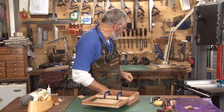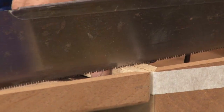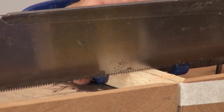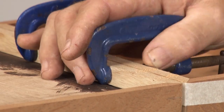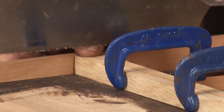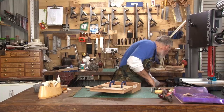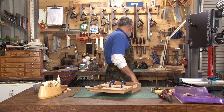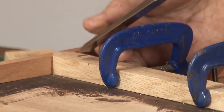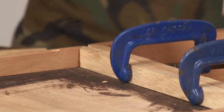Now if you want to, and you're very gentle, just take that down a little bit with a very fine saw, just on the inside of the cut, but don't go too deep because you don't want it to go deeper than the depth of the hinges. And then grab a sharp chisel, and I just notch out up to that line, so I've got nice registration marks.